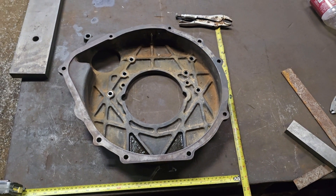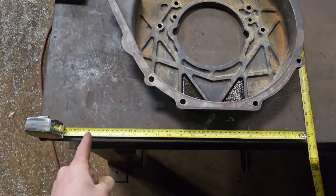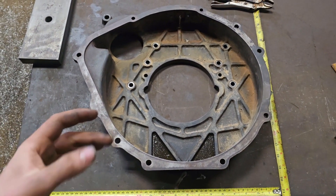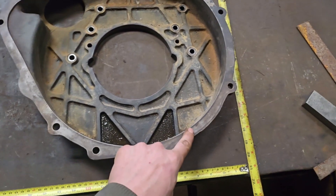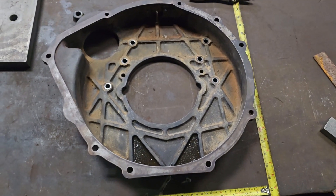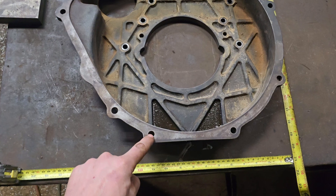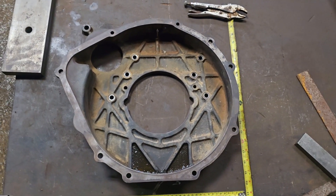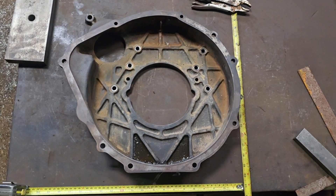The next step is to take a photo of this plate with tape measures for scale. When I upload the photo I can scale it to size. I'm not going to use this to get exact bolt hole dimensions — just to get the general shape for plasma cutting. For the holes, we're going to use a milling machine with a digital readout. You just hold the camera still, snap a photo, and then I can upload it to Fusion 360 and draw it out in CAD.